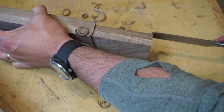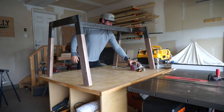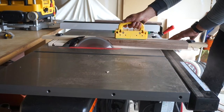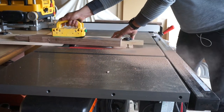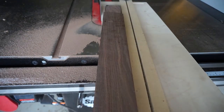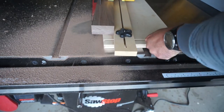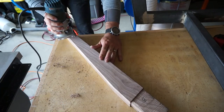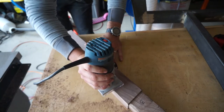Then I dry fit them into the base. It looks pretty brutal with the square walnut extending all the way down, but my next step was to cut some tapers to fix that. I pulled out the taper jig and marked out where I wanted my taper to begin and end — I wanted the end of the leg to be one and a half inches wide to match the square tubing. I cut the remaining three legs so they were all the same. Next I took my palm router with a one quarter inch round over bit and rounded all the edges to match the rounded edges of the steel tubing.